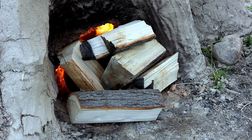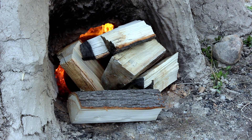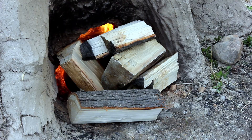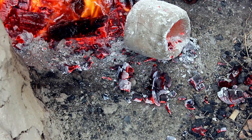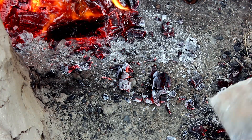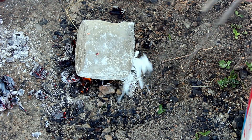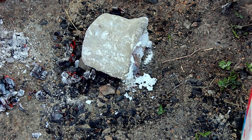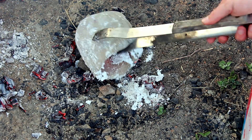So the first step is to heat the pottery up. Since it's fired already, you really don't have to worry very much about how fast you're raising the temperature. I got it up to about 1600 degrees Fahrenheit — that's around 900 degrees Celsius — and I've watched video of people applying borax glazes and they make it look easy. I realized too late I needed longer tongs, that handling this red hot pottery next to the hot furnace was going to be an absolute nightmare, and that the constricted mouth of the crucible was going to be quite difficult to apply the borax to. So instead of sprinkling a light delicate layer of borax onto the crucibles the way I think you should, I kind of ended up slopping borax on. This is not good because apparently you can end up with a weird puddle at the bottom of your crucible, and that melts again when you put it in the casting furnace and mixes with your metal when you cast.